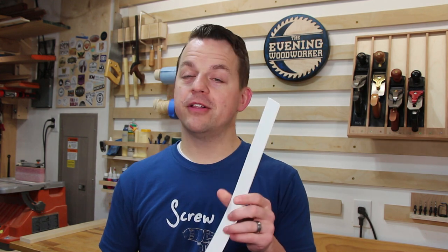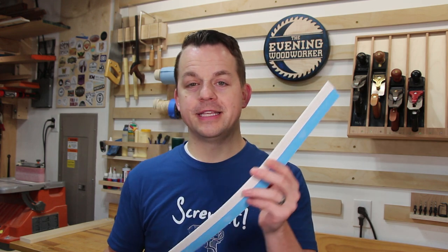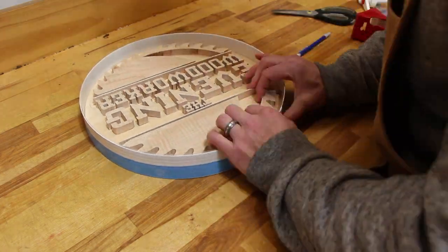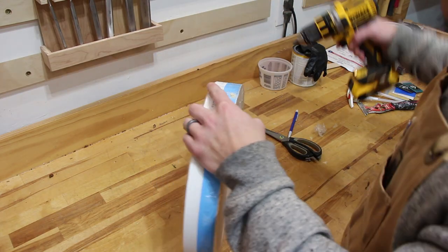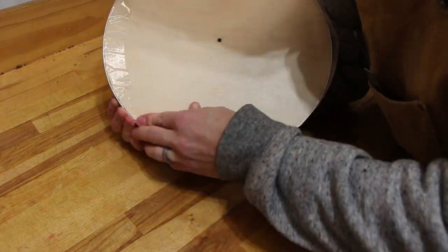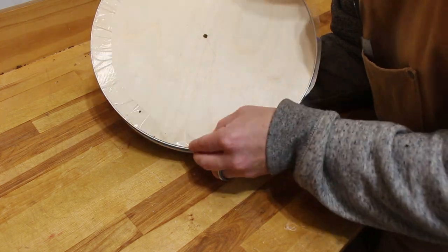The challenge was to make a smooth circular mold that wouldn't leak. After wandering the aisles of Home Depot for a while, I discovered this vinyl exterior window trim that has an adhesive on one side — it's flexible, it's 12 feet long, and the best part is that it was only nine dollars. I tried wrapping this around my plywood circle and it worked great. I also lined the inside of the trim piece with clear packing tape since this releases well from the epoxy. At the joint of this window trim I added a pan head screw to hold that part tight against the plywood. The base of the plywood was covered in packing tape around the edges, and I also tried to seal around the bottom edge too to prevent leakage through the crack around the edge.